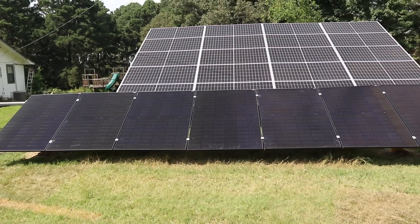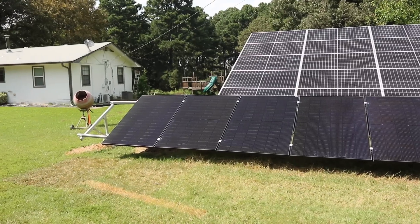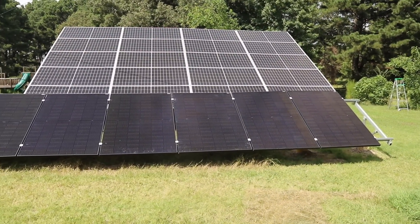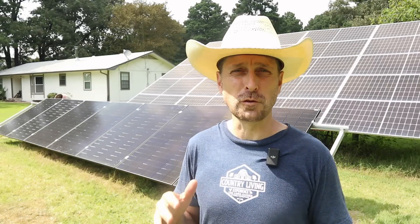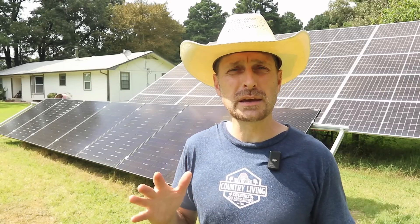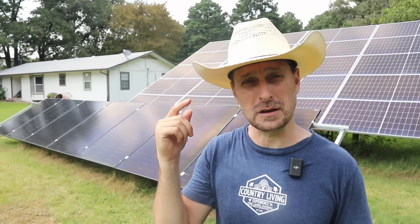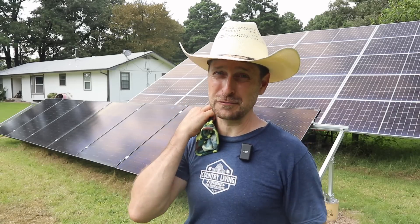There it is - I've got seven panels on there. I know it looks like I can get eight with a little space on the ends, but I can't; they are just a touch too wide, probably only about four inches. Just make sure if you get these Sirius panels with two bright mounts, you can only fit seven. We've got the seven panels up and I'm pushing about 233 volts with a one series string of seven panels, well within my parameters for the EG4 6000 XP.